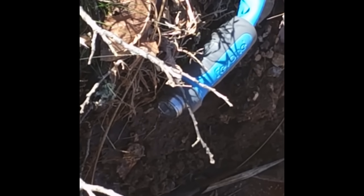It ain't going to be anything fast. If you're trying to fill up an IBC tote at 250 gallons, that'll take you about 30 hours. Not bad. My plans going forward: I'm probably going to change this out to a 3-inch drive pipe down there to get 3 times the pressure. If I'm pulling 3 times the water — potentially 36 ounces a minute — now I'm pulling 400 gallons a day. Now we're talking about having some water.